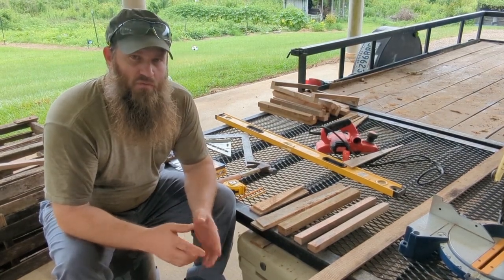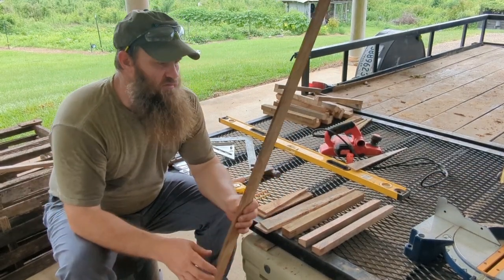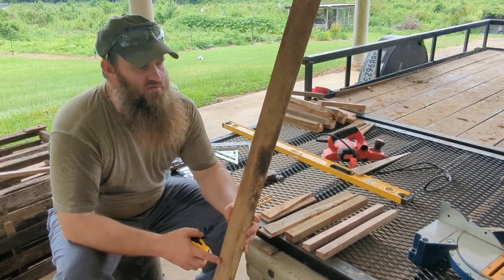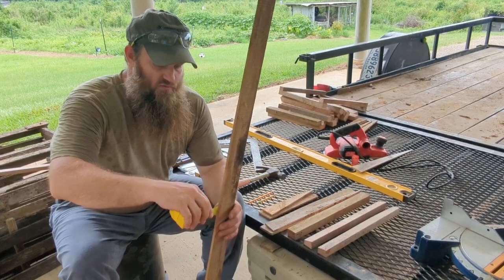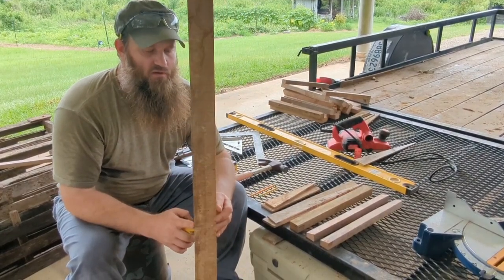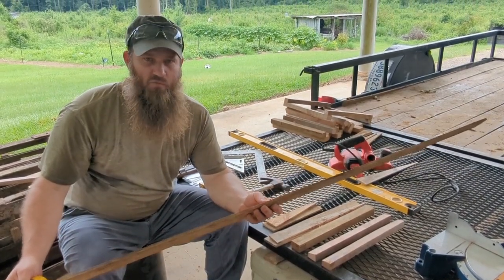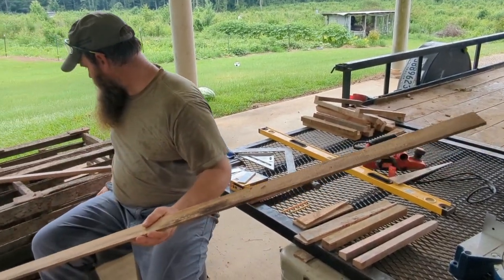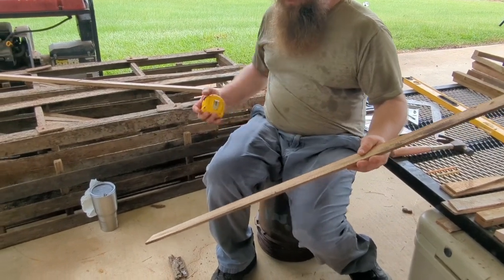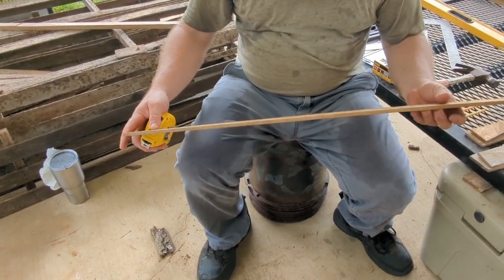I'm going to go through the wood real quick and what we're going to cut it down to. You're going to need some slats. This slat is one Dad had already cut — he had a bandsaw sawmill, so it was really easy for him to cut wide slats and just rip them up into two or three-inch sections. These were two-and-a-half inches by one-quarter inch thick, and five-foot long for a five-foot trap. You can see on the ends where he just took these two-and-a-half-inch ones and notched them for the one-inch holes. Right now, we're going to start out with these just cut to five-foot.